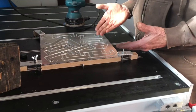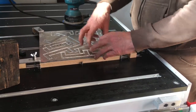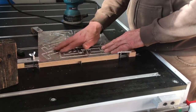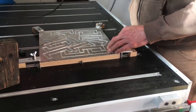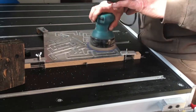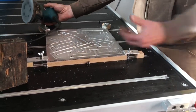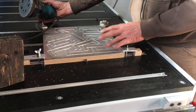Well, hot dang — now I know where all the different parts are and where I need to put screws down to hold them down when I cut them all the way through. I'm using a pretty beat-up cutter because this is a new thing and I'm not using coolant, and that gave me big burrs that are really ugly. So I just take my little orbital sander here and knock those burrs off and give it that jeweled look that people like.